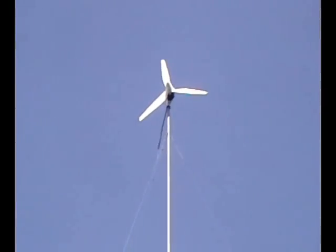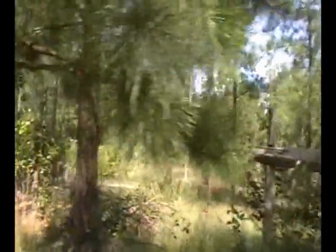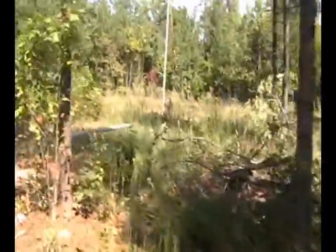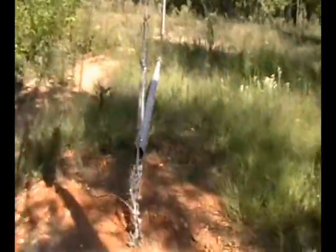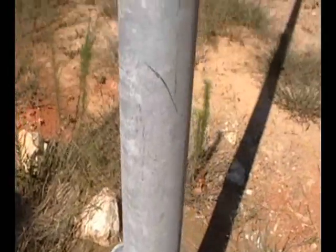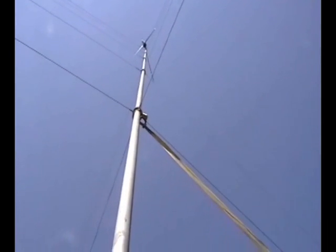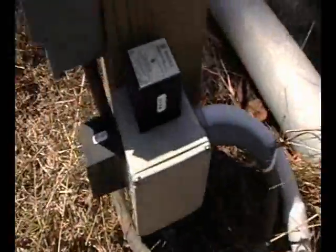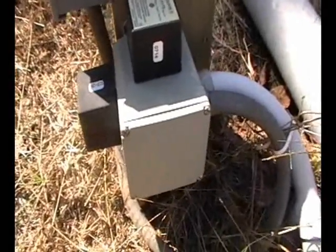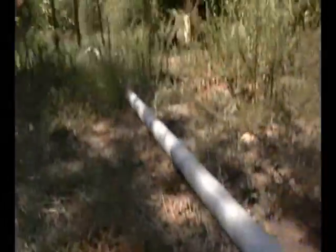Here's the wind turbine, but unfortunately the wind is not blowing right now so it's not producing any power. From the turbine there are three power wires — it's three phase, so there are three phases coming down the pole. The type of wire I used to go down the pole is underground UF cable, which is extremely hard to get the wires out of because the jacket is so stiff and durable. Those three wires come into this box, and then there are three wires coming out the bottom of it through the ground and into the power station.